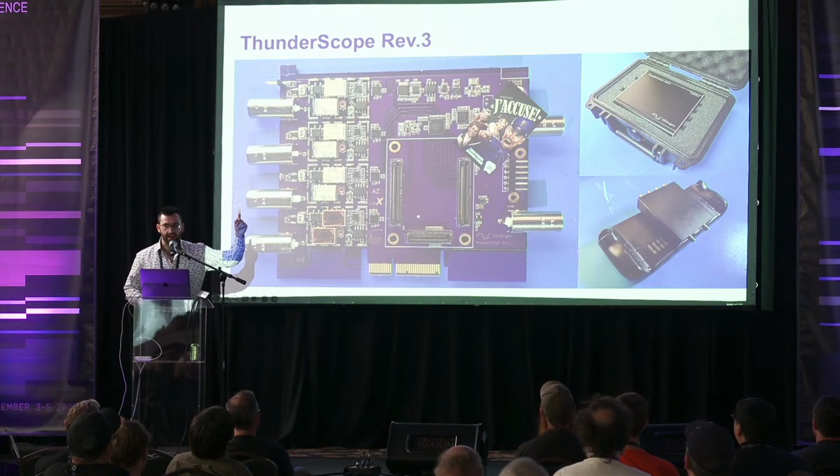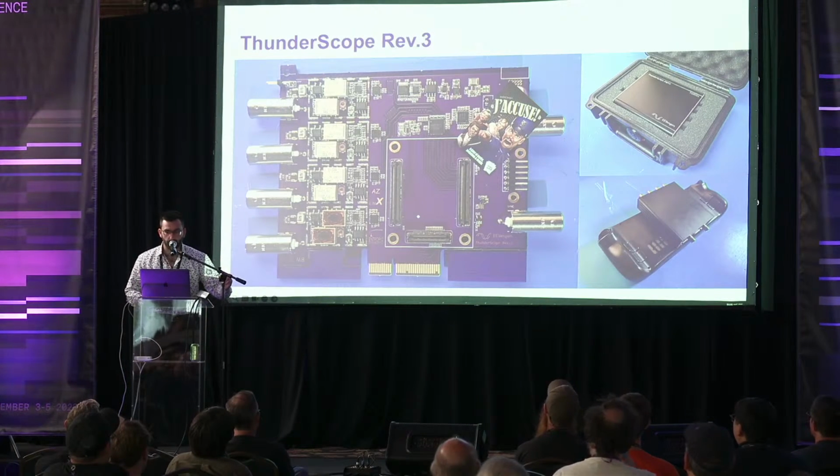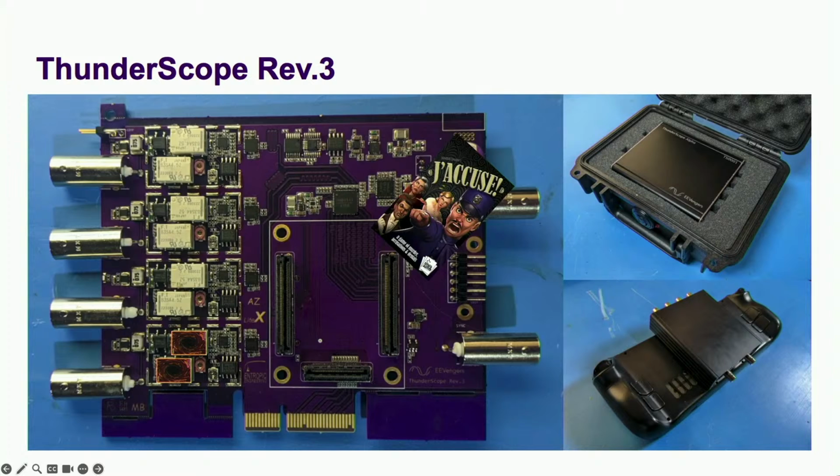It was the ZL30250 in the ADC clock domain with an AC LVDS output, meaning the clock generator's output amplitude was too low for the ADC. A temporary fix was to remove its termination resistor, and since I got this rev working, I sent a few of them out as alpha units and even used it as an excuse to buy a Steam Deck. Should I say a scope deck?